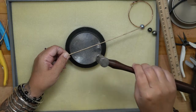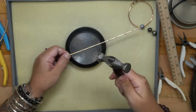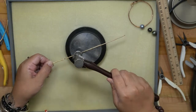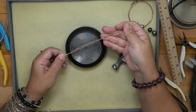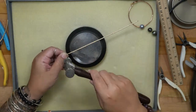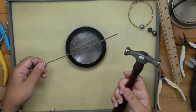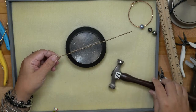The next texturing hammer is the waffle — number 22 with us. This puts a texture like little dots into the metal, and for this one I also like to hit once and hard. I kept my hammer relatively in the same location and moved the metal to where I wanted to hit it. That gives you consistency in your hammering rather than hitting all over the place and sometimes missing.